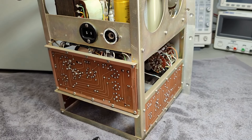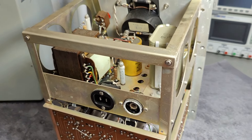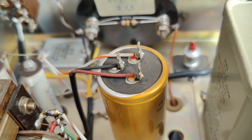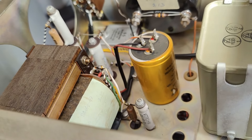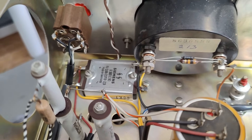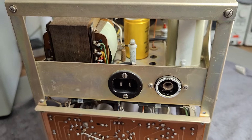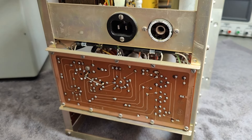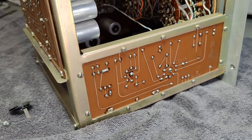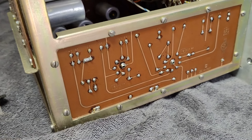I'm still doing my little visual inspection inside. I don't really find any alarming issues — capacitors didn't leak. We don't have any burned power resistors or any leaked rectifier bridges or anything like that. And I can say that I totally misjudged the complexity of this unit — it's really, really full of tubes. So that will be the start circuit.